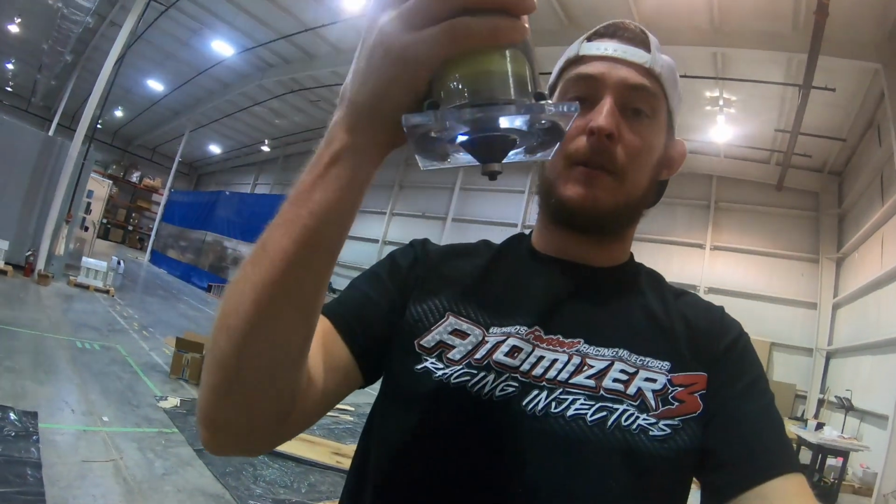So anyway, this is how I finish the bottoms of my tables. We're going to go ahead and do a bevel with our router right here. At that point, we'll be done with the bottom, and the flood coat will then wrap around the bottom edge we just cut. And really, when we're doing the top, it also finishes off the bottom, okay?